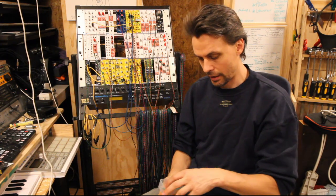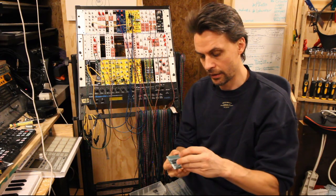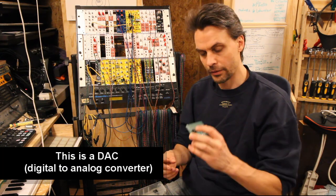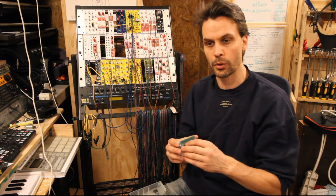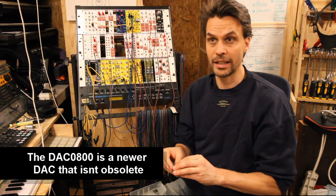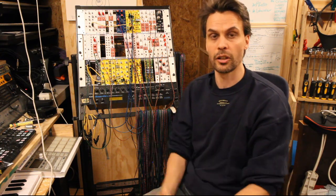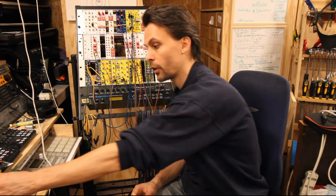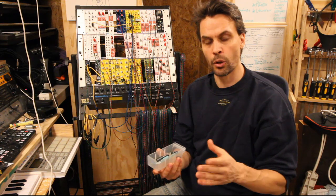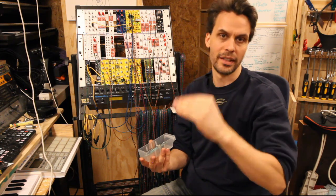For this I started doing an old analog one. Here's the beginning of an ARP-style quantizer using the AD7245. It's either the AD7245 that you need to use, or there are a few newer modules that use the DAC0800, something like that. Those are DACs — digital to analog converters — and that is together with an LF398, so a sample and hold. It just goes through these 12 steps probably and decides which note this one has.